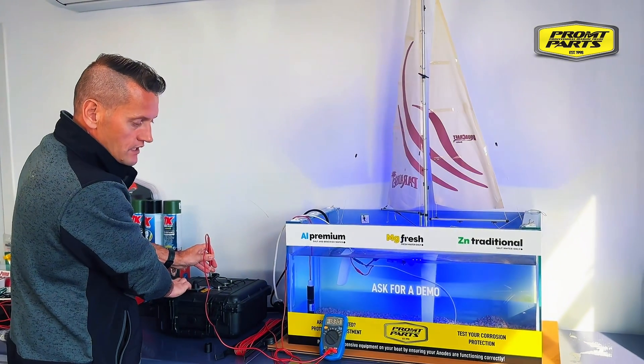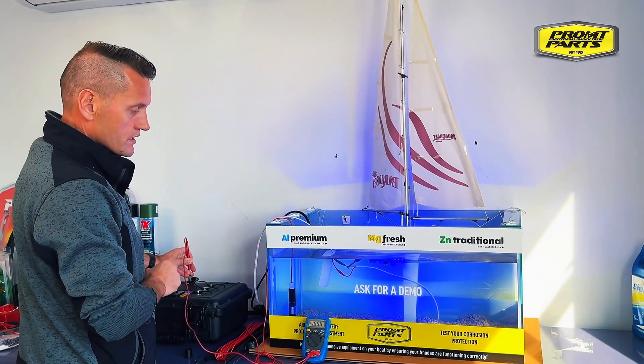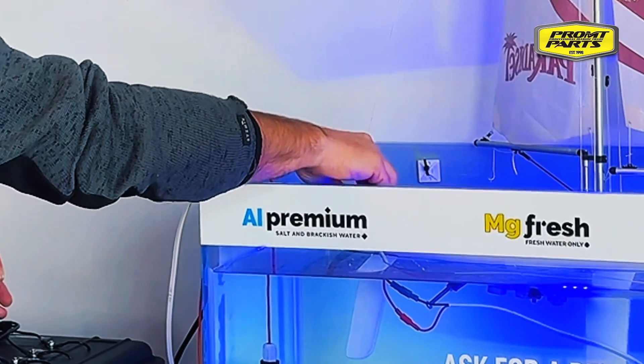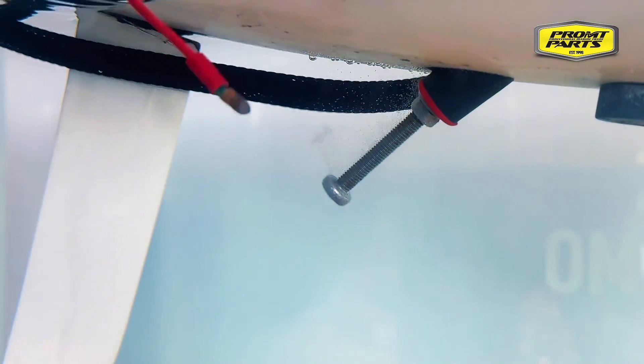As we turn our light on we see that value jump up to 1.8, 1.7 volts — a very bad leak in this tank with the live bait tank underwater. That is creating a stray current and all of the underwater metals in here are starting to dissolve.